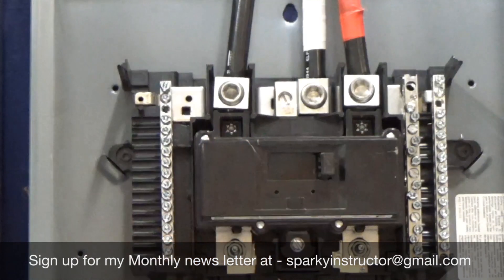Just because you have a main breaker does not mean that it's going to be your first means of disconnect. You could have another breaker two or three hundred feet away in a dwelling, maybe on the second or third floor, or a main breaker down at the meter. If the main breaker is at the meter, you have to make sure that you combine the grounds and the neutrals together — they can share each other. That's our main bonding point. Once you get into another panel — called a sub-panel — you have to separate the neutral and ground. We'll show that in another video.